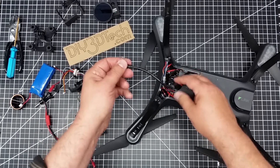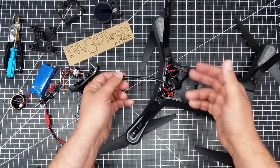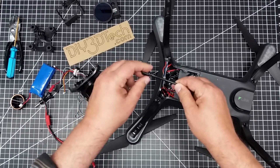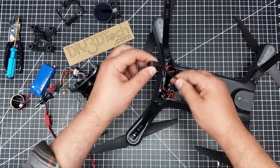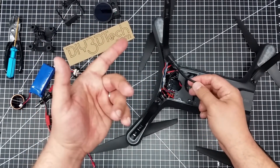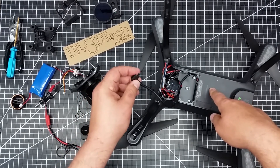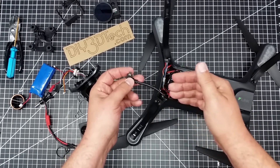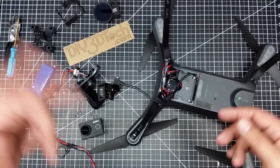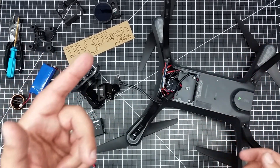For the third episode, I'm going to rework this HDMI cable. It plugs into the HDMI port and I've flown with it many times, but it's very stiff. I'm going to remove the sheathing, remove the ferrite core — I don't think EMI will be an issue — and possibly remove some wires to gain flexibility, because this cable is going to fight the gimbal the whole way. I've looked at ribbon-style HDMI cables but I'm not sure what this terminates to internally — full HDMI or micro-to-micro. I'll try to use the existing cable first. If you've done something like this or have suggestions, comment below, and don't forget to subscribe for regular drone content!